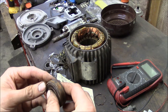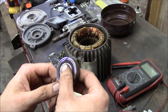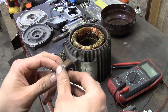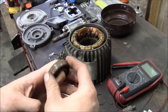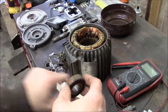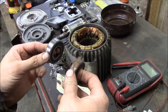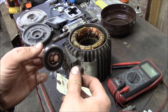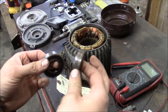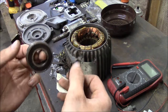And yeah, part of the fun of taking things apart is that you can see what's happened before. It's all about detective work. And I know that this motor's been apart before because the nameplate here actually specs the bearings. There's a 6204 and a 6205ZZ, which would mean dual shielded bearings. And these are sealed bearings, 2RS series bearings. So somebody's been in there before.